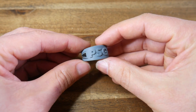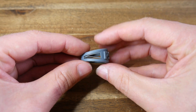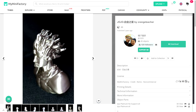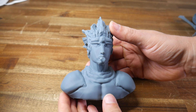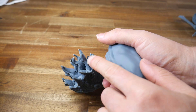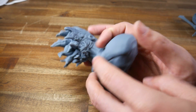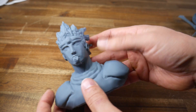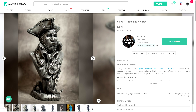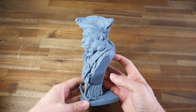This is a simple design, but it acted as a proof of concept — everything is nicely formed, including those narrow parts on the band. I then stepped it up with a bust of Star Platinum from JoJo's Bizarre Adventure — a model intended for FDM rather than resin printing, but this printer did a good job. The built-in tree supports weren't really meant for resin; some were hard to remove and others damaged the model in the process. Next, I stepped things up significantly with a pirate and his rat bust from Eastman.